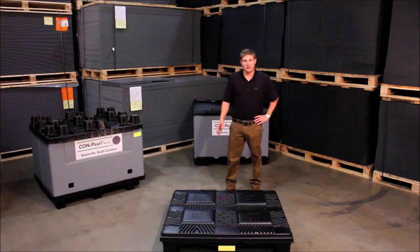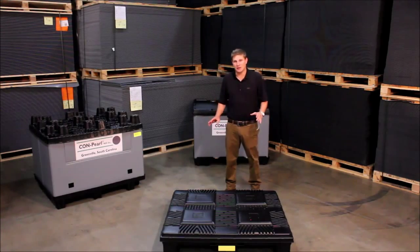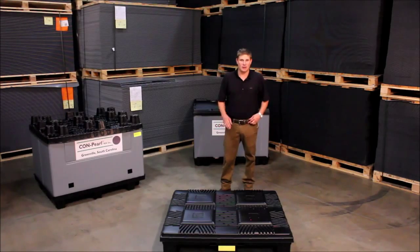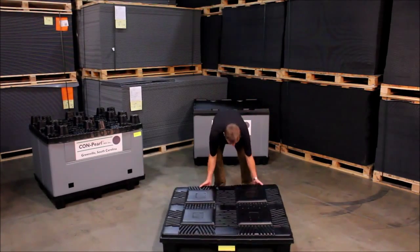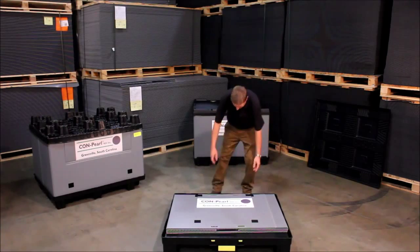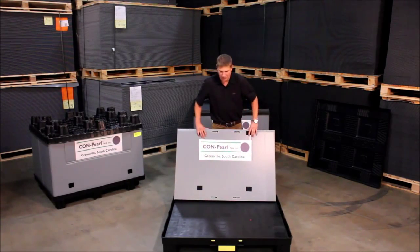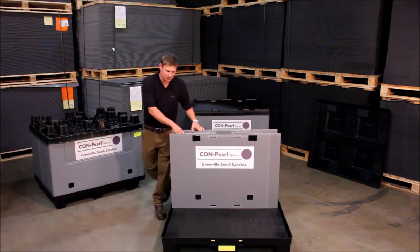The next type of system I'm going to show you is an injection molded pallet. There are only a few different sizes available in North America of the injection molded pallets that have a sleeve track to capture the sleeve. But the main advantage to this pallet is the flat deck — as you can see across the bottom it's just a flat deck, which is easy to handle the sleeve, and at the same time your parts don't get stuck inside.